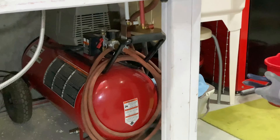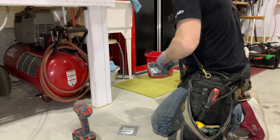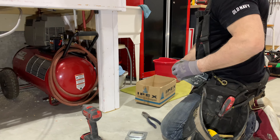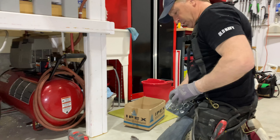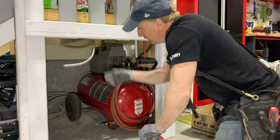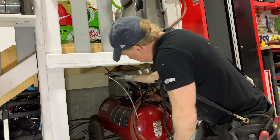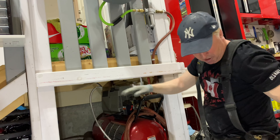So here's the power for our compressor. Dave is now installing. We're going from 15 amp to 20 amp for the plug and breaker. I decided at the last moment to put in 12 gauge 20 amp so he has it if he needs it. Better to have it now than wish you had it later — very futuristically expandable.